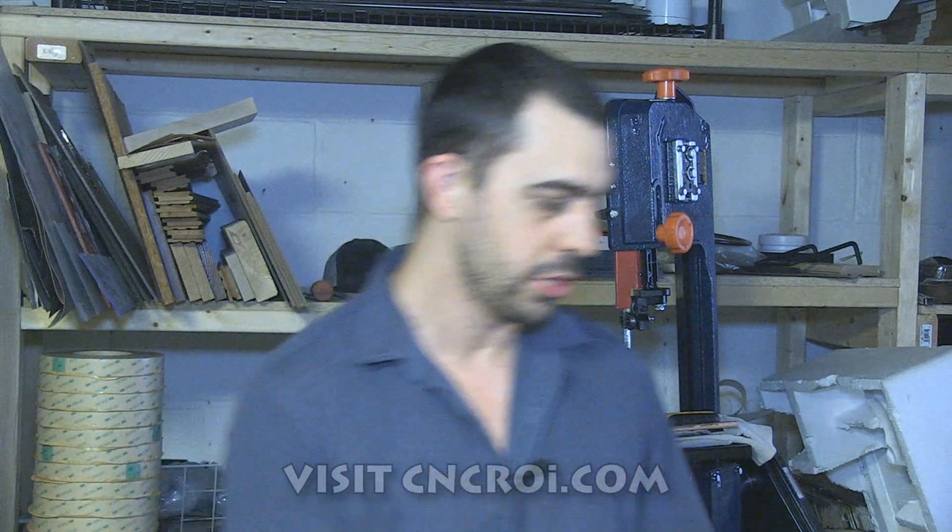The way this is accomplished is pretty straightforward. All we do is go increasingly out of focus with the laser so that the depth becomes more and more charcoal-y or darker. If you think of a laser, it's just like a magnifying lens — this is the cone from the laser and this is where the beam is the strongest. The more you go out of focus, it crosses back again so you have the same power over a larger area, and on wood what that creates is charcoal. That's why when you look at the video you'll see we did five passes over it, and each one creates a darker and darker look, but it also creates a nice little 3D rounded edge around it, just like you'd see on a real branding iron. So let's take a look at that happening right now.